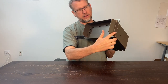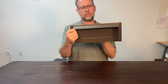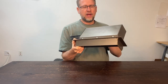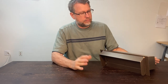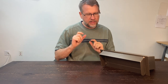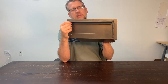The rain guard is welded to the face plate. The main frame face plate is 14 inches wide by 6 inches high — it covers the cut marks you put in the wall when you install this. Run your screws into your studs on the interior, and we recommend running a bead of caulk around it before adhering it to the wall. The rough opening is just a little over 4 inches high and a little over 11 and a half inches wide — cut that in, slide it in, run your screws, and you're all set.